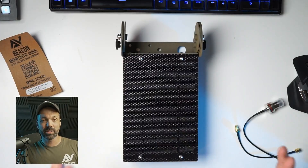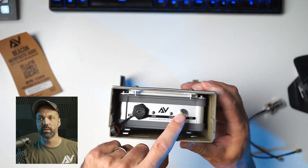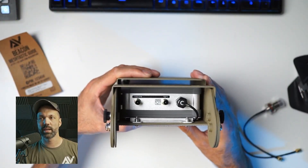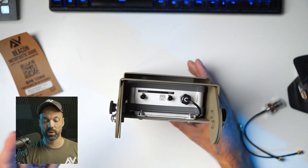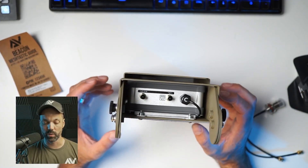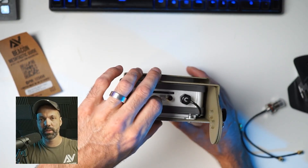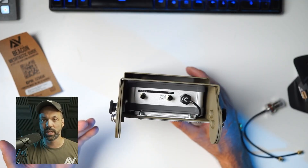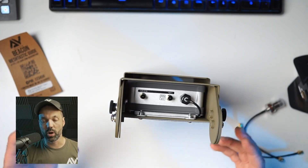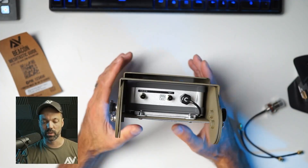These pigtail cables are what you'll use to connect the enclosure to the antenna rail so you can mount your antennas. Mounting antennas is something you want to do before turning on the device — if you don't mount your LoRa antenna prior to powering on, you could potentially burn out your radio. As a precaution, we always ship these without setting the LoRa region, which prevents the radio from transmitting, but try to connect the antenna before turning the device on.